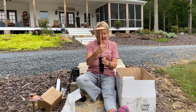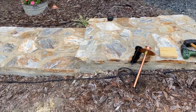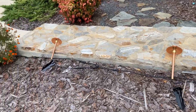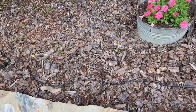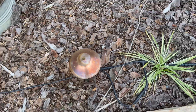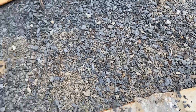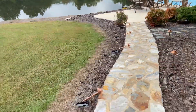Okay, we have all of our lights assembled and we've determined where each light is going to go. We've also already attached all the wiring so we know everything is going to work out. With the existing lighting already installed back in the summer, we've gone in and connected into it with the cable, so all the lights will run off the same transformer. Because we're bringing this around the sidewalk, we've gone ahead and buried the cable underneath the gravel at the end of the sidewalk.